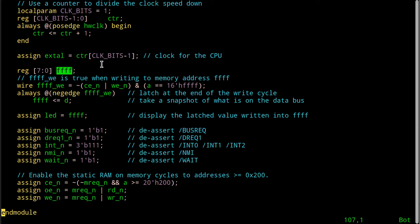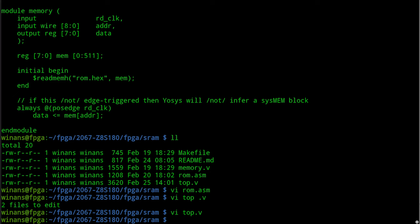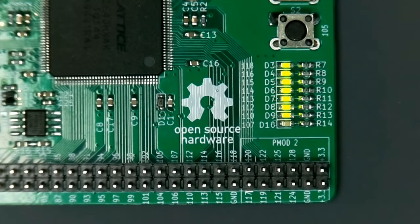every single byte of memory from hex 200 all the way up to FFFE, and if you want to be a stickler for detail, was properly written into and read back out of. Okay? So this is a pretty decent sanity test, in my opinion, of the SRAM. If this thing works and it creates an inchworm type display on the LEDs, then we're pretty much sure that we're okay.